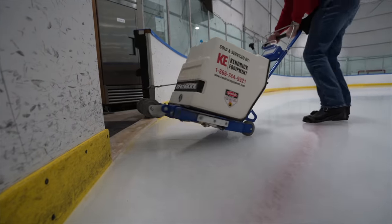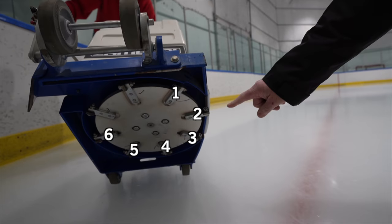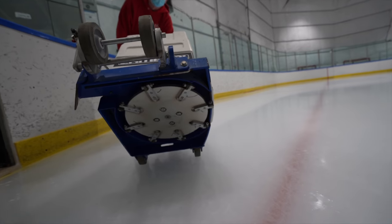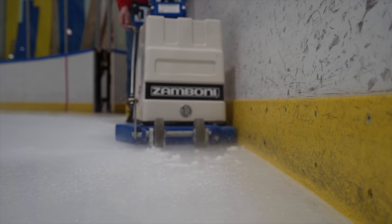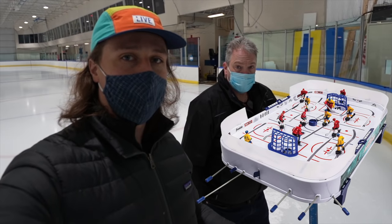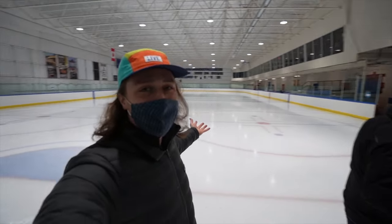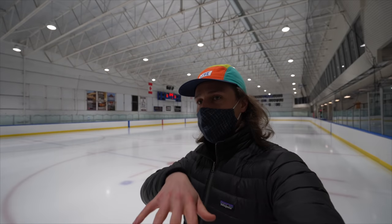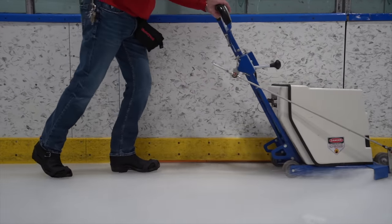The other tool they'll use is this little machine that looks like a mini Zamboni — it's an edger. It has eight tiny four-sided razors on a plate that spins to trim the ice. It can get really close to the boards to make sure there's no lump or edge that you could skate over and trip over. In table hockey, it's good to have high corners, but in real ice hockey, you don't want high corners. It's kind of like the Zamboni is the lawnmower, and this is the weed whacker that you come in and do around the tree and the little fine edges.